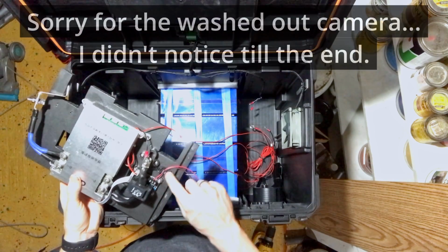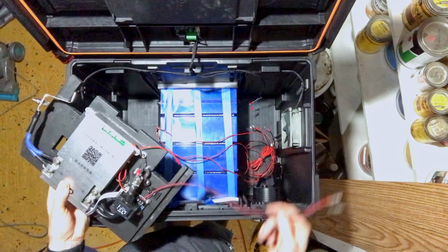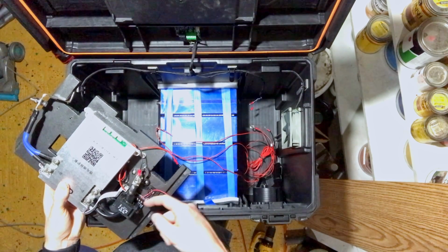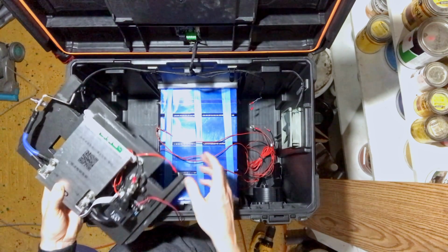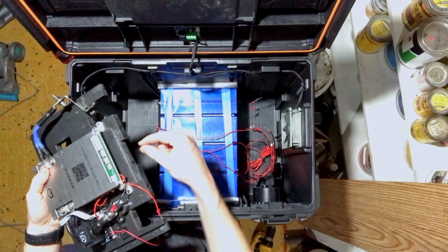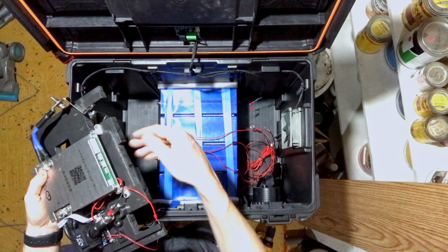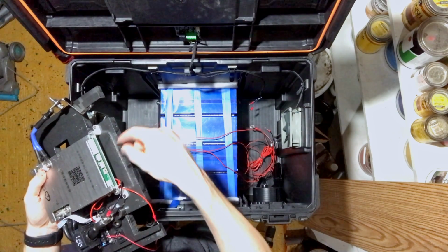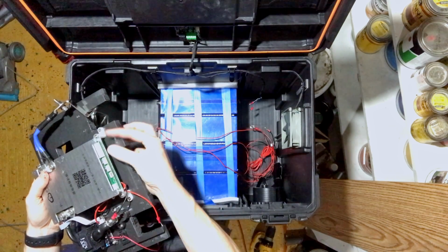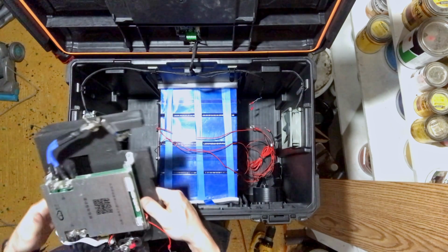Alright, just for a little extra strain relief, I did put this tie down right here for the leads going to the relay. So it should pull on that and not try and pull them right out of the PCB. See, I've got a notch right here. That's where I'm going to have all the balance leads coming up from the battery area and over top, and I'll probably stick the excess underneath the BMS and then bring the one ribbon connection right up here to terminate in.